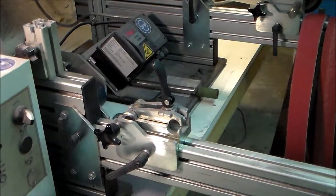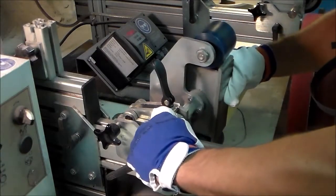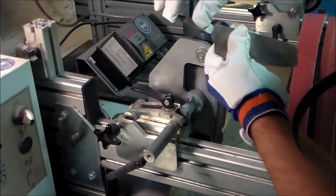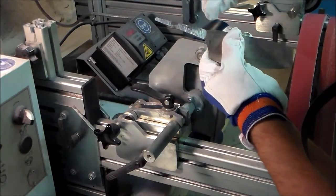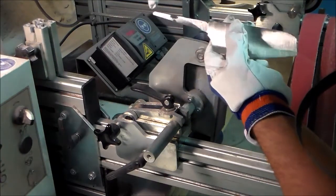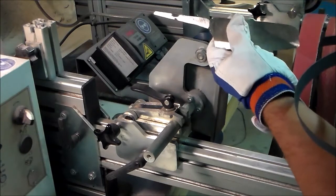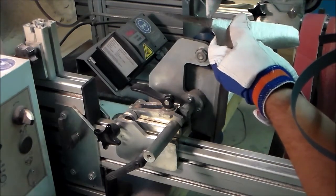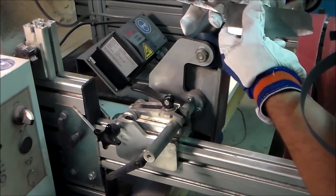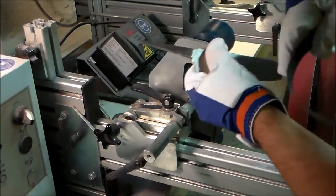Okay, that's looking good. Final thing to do at this stage is to clean up the tang just a little bit until the taper runs to the place where the bolsters are going to be. If I make it tapered from this end all the way to the bolsters, it's fairly easy to make a bolster that fits snugly. If this part is wider than this part, then logically the bolster has to fit the widest part and there will be a visible gap here. So just a bit more trimming.